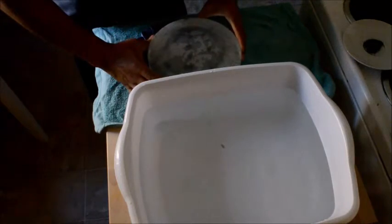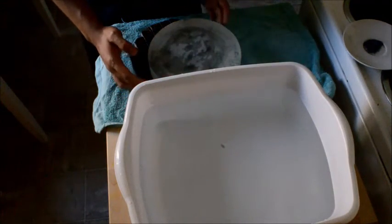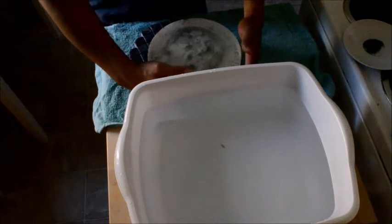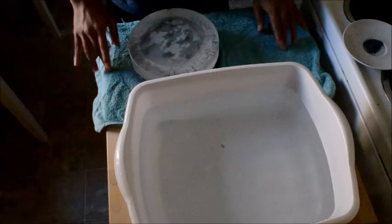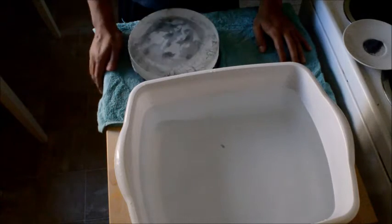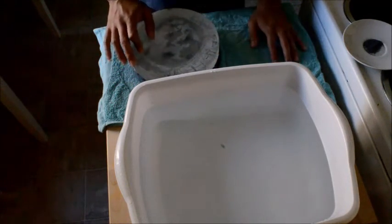Another thing to think about is when it's grinding, it will actually grind the middle the most. When I'm pushing this forward and back, the sides aren't being ground as much as the middle, and so that's also how you get that little parabolic shape. And this process, for me, will probably take about a year, but in terms of the number of work hours, the mirror itself could take about 50 hours. It really depends on how big the mirror is. Mine is an 8-inch in diameter.